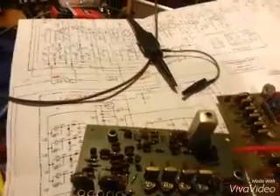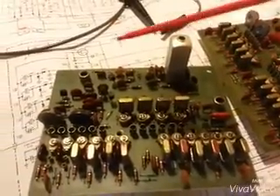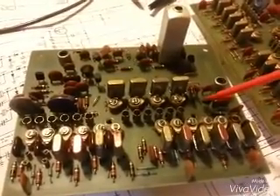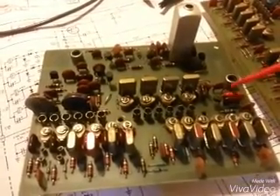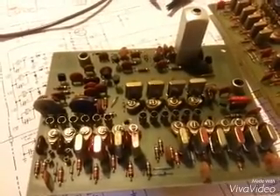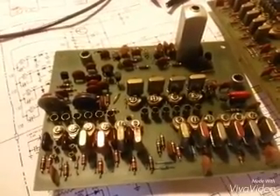What that MOSFET does is act as your 4MHz oscillator when you're in crystal control. When in manual tuning, the 4MHz signal comes in through this jack and the oscillator is a vacuum tube. But in crystal control, this MOSFET is the oscillator. That's why I can't get even volume between manual and receive circuits — because this is installed backwards. It's working, obviously, but it makes a really crappy small waveform because it's not doing what it's supposed to do. The voltage is going through the crystals and it's oscillating, but it's not amplifying the signal at all — it's actually distorting it.